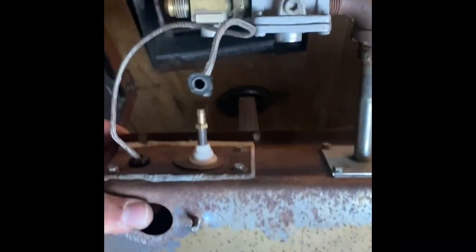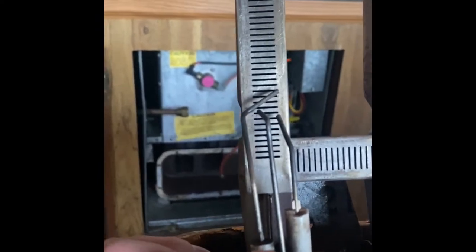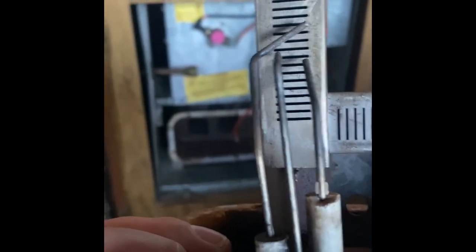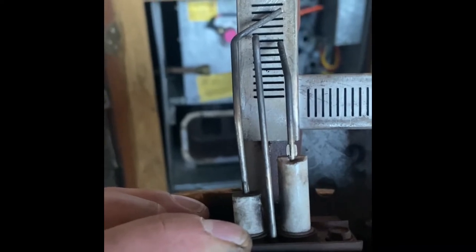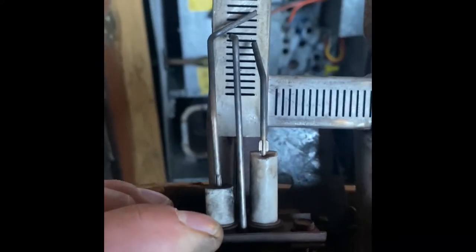Here's the furnace pulled out — this is the front, it slides in there. There are three electrodes. The third one on the right sparks with the middle one. I've spaced them out almost lining up with the width of those burner vents. Any bigger than that is really just a waste when trying to get the spark to arc across. We're going to check it, hook it up without the gas, and make sure that spark is good.